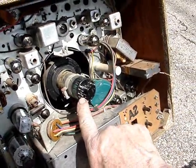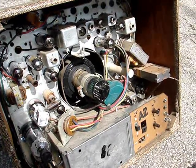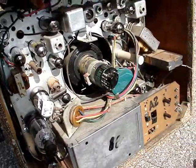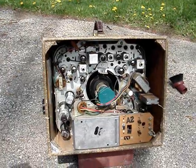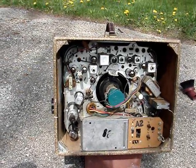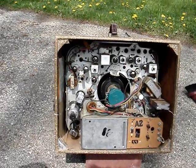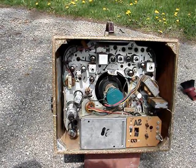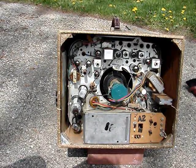I touched up the filament pins — I had to heat it up a lot more than I liked. Hopefully that won't break the tube, but we'll see. I got the filament wires working now so I can get some action on my CRT tester, and that tube is about as dead as dead can be — it just barely has emissions. So the bottom line is I'm not going to plan on restoring this set unless I find a 14SP4 tube for it.